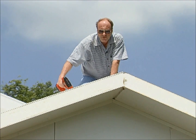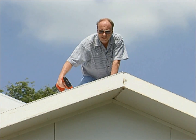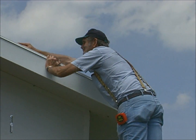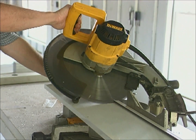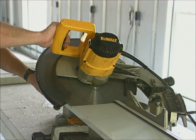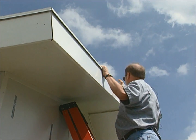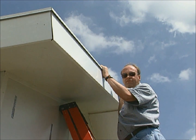As we get to the end of the roof, it may be necessary to cut the last panel to make sure that the overhang is consistent with the other end of the roof. When all roof panels are secured in place, the fascia trim can be installed. All corners are mitered at a 45 degree angle. A thin putty knife will facilitate the installation if the fit is tight.